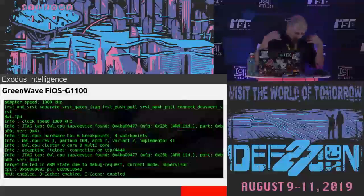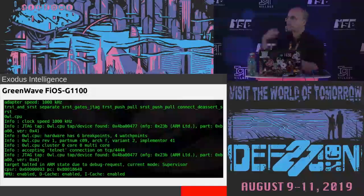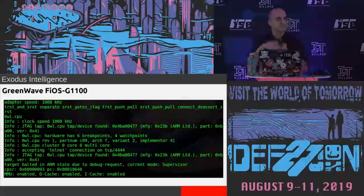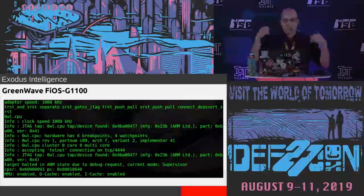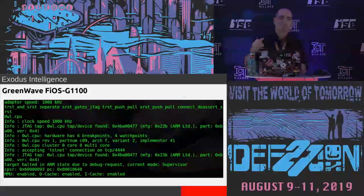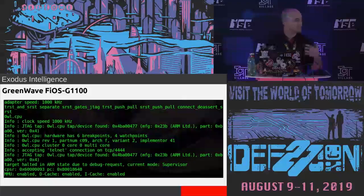So before we get on to the next slide, the first thing I started doing once I had JTAG was, I don't have a data sheet for this chip whatsoever. So I'm dumping memory addresses. If something is not accessible, I just write that out. So I'm dumping, halting the boot up process at different stages. I'm trying to find the kernel boot arguments. So after about an hour or two, I think about 2 or 3 hours, it was kind of a while,